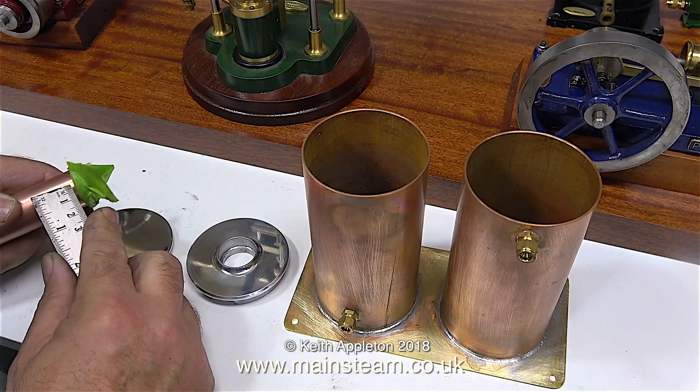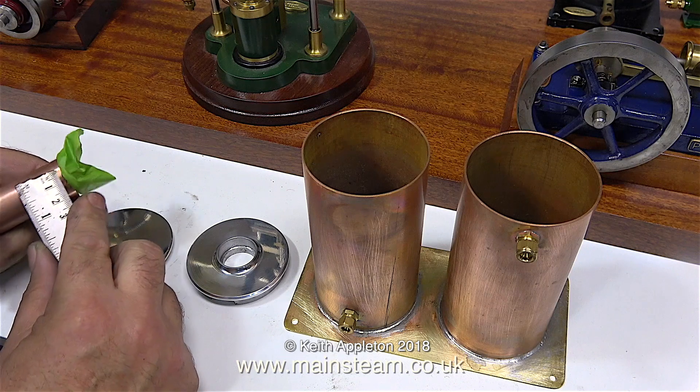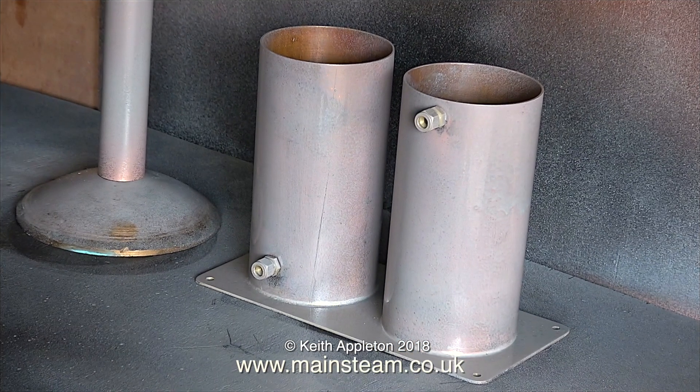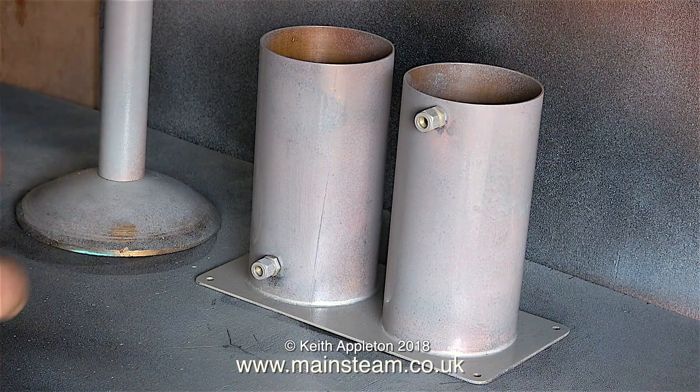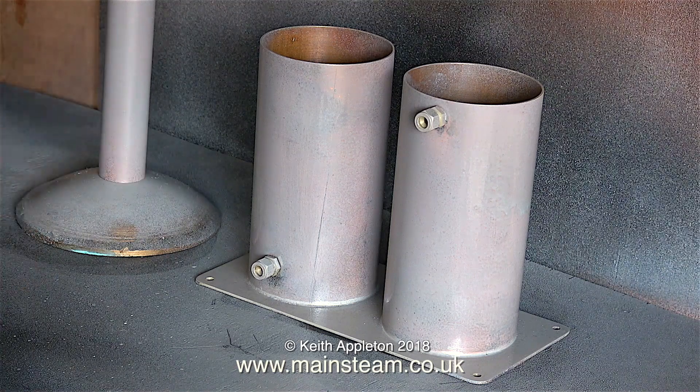It's almost painting time, but first I'm going to mask off the brass cap. I need to make sure none of the masking tape is on the copper part, so I'm using the edge of a ruler to make sure. All the parts are ready for painting — I found a lump of scrap brass in my scrap bin to support the chimney — and I'm spraying the parts using Precision Paints etch primer. I really do like this stuff. You must be able to see the metal through the paint, which means the etch primer gets plenty of oxygen to do its job. That's it for this episode — thanks for watching, I hope you found it useful.